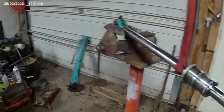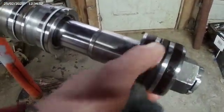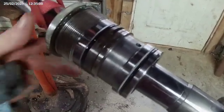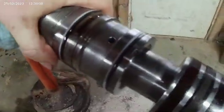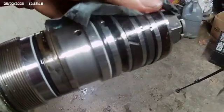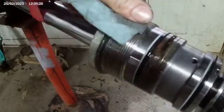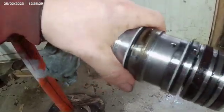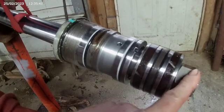Now that we have this apart, I'd like to show you — this is the piston here, and this is kind of a cushion valve. As that rod extends out, that oil goes up into there and using these holes it goes on top of that. That creates turbulence to somehow make a hydraulic buffer of turbulated oil, as best I understand. So that it doesn't just slam. Because if you kept doing that under full power with a load on the bucket, it would eventually rip your rod's threads right off.